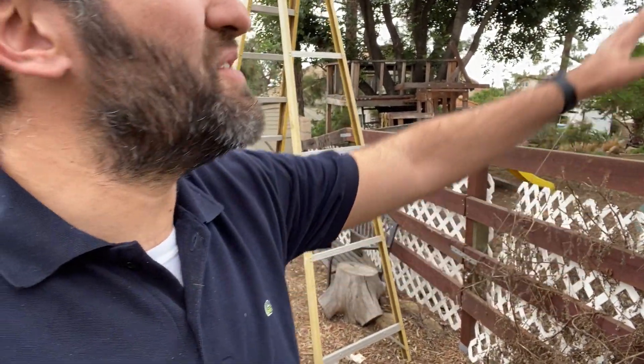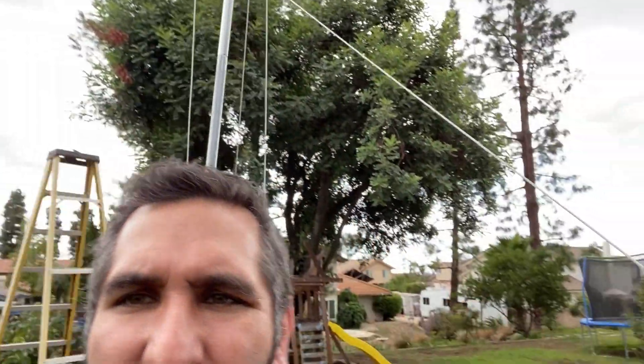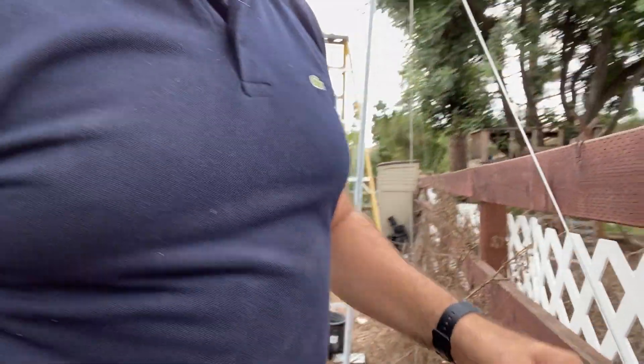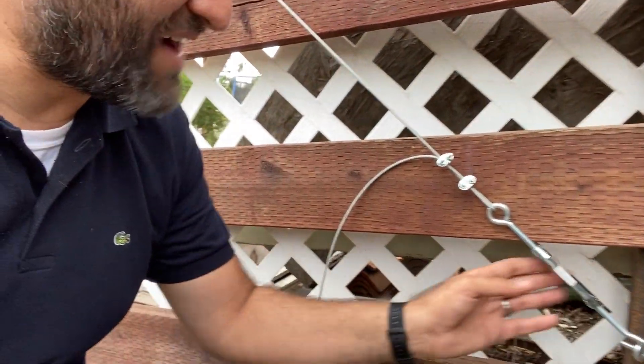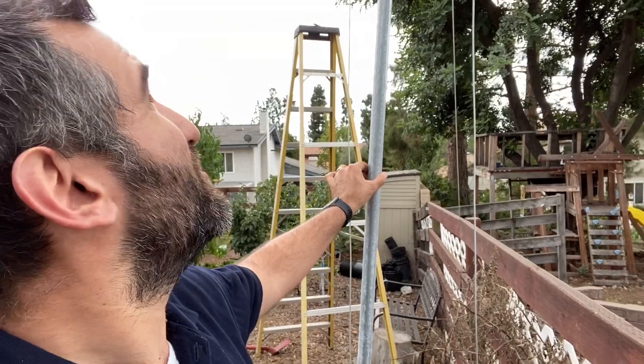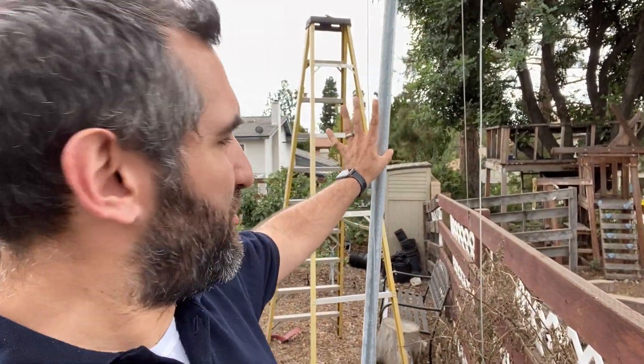Another thing I was really careful to do was to have a couple of guy wires attached to the top of this thing to provide some pressure going back in this direction, because those lights are going to want to pull the pole that way. I attached these wires with a little turnbuckle — I haven't really had to tighten it and there's still tension on here — attached to a little eye hook I put down there. This pole, which is fairly flexible normally, is really not moving at all. I'm applying some pressure to it and it's holding pretty firm, without having to go into my neighbor's yard.